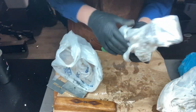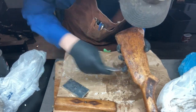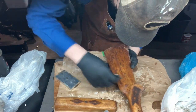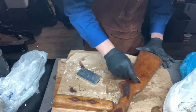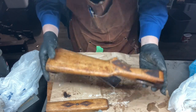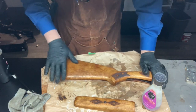See how that varnish has just come right off? This is not scratching into the wood — what we're doing is just removing the varnish. We'll clean this up a little more with a nylon brush, then neutralize everything with some alcohol wipes and nail polish remover to remove the last little bits. Then we'll move on to sanding.